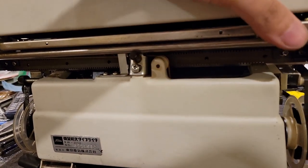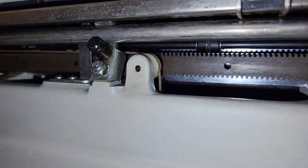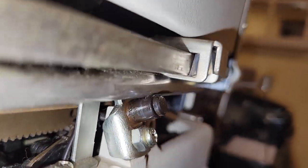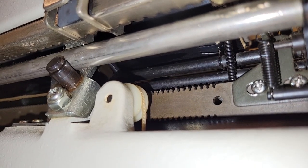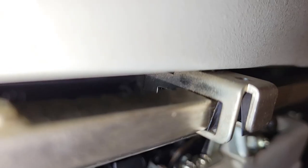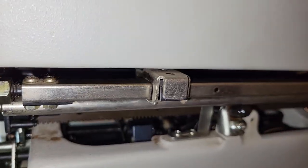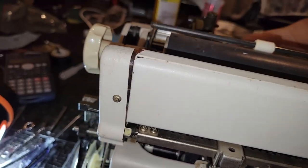As far as I can tell, this machine does not have any margin release mechanism. This here is our absolute margin stop. So if you hit here and give your tab, which would be contacting that side, then over here you will realize that it actually slots over in order to clear the tab. So you basically only get a bell trip. There's no line lock.